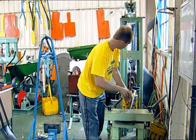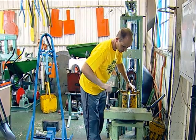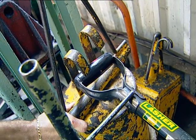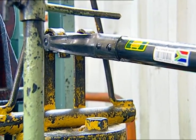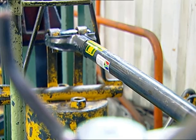What you can see here is what we call the bend test. This test is done to see the structural strengths and weaknesses of the product. Here you see a Lasher spade being clamped into the apparatus and a weight being applied to the handle. When released, the product should return back to its original form, or at least within a 25mm set of its original position.